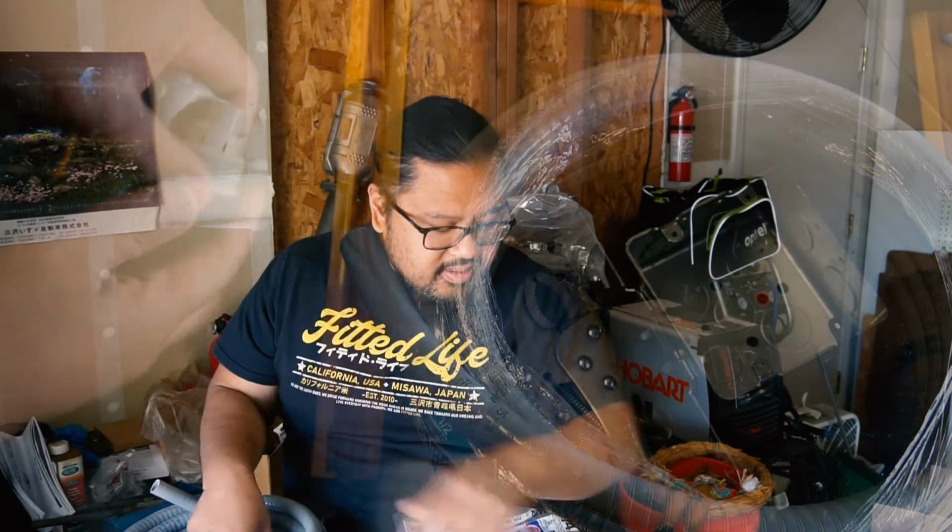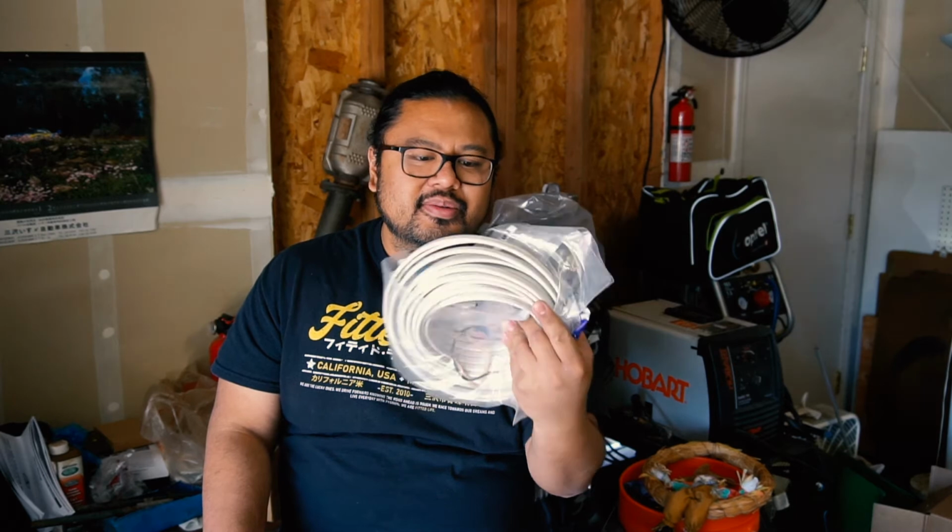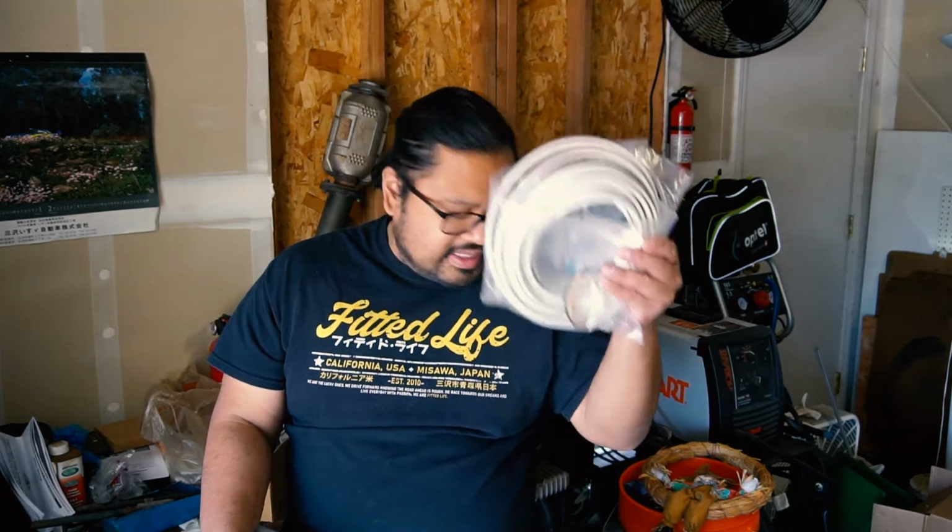And lastly, you need wire. So this is a 14 gauge 2 conductor with ground. This is very accommodating if you're running anything electrical within the range of 15 amps max. So this is the Romex. Always nice to have when you're doing electrical. And later I'll show you some really neat connectors that I came across. They're very easy to install, and they're all just snap in.